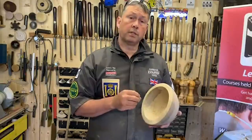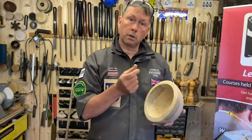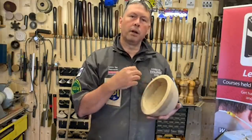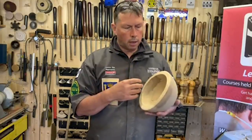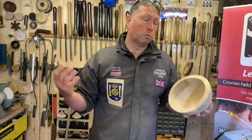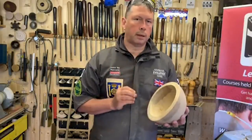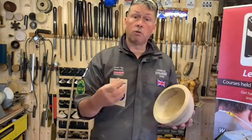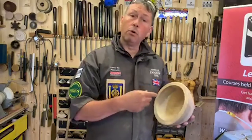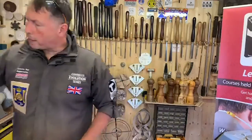The best thing, best advice, if you're not going to use anything else, you're going to keep with it, then just take a very fine, resharpen, so turn the carbide bit around, a nice fine finishing cut, just tickle it, and you're doing less raking when you're doing that. But it is an issue. You will get that, whether it's carbide tip or a normal scrape, you are going to get it. If you can get to a bowl gouge and cut the grain, it will work better. And with a bowl gouge, put a secondary bevel on as well, take the heel away. So you're then presenting a convex curve to the bevel to your concave curve of your bowl. Just helps hugely. So I hope that's answered that one.